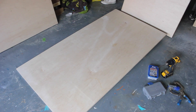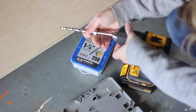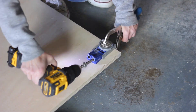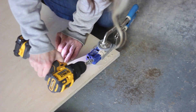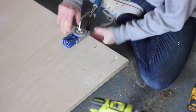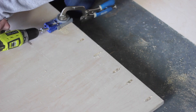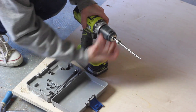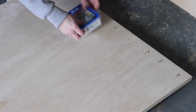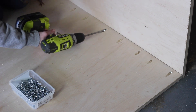After all of my plywood had been cut, I laid down one of my large 63-inch by 33-inch pieces and put some scrap pieces of wood underneath it to elevate it off the ground a couple of inches so I could clamp my pocket hole jig on more easily. Then I drilled a few pocket holes along each end. Drilling pocket holes into hardwood plywood is not the easiest task — it took some effort because I'm used to using it on soft wood like pine.